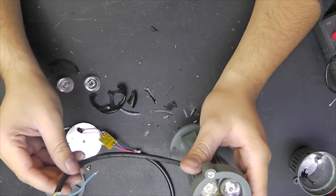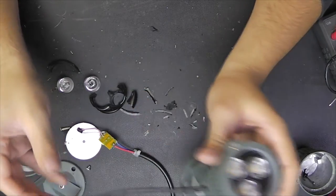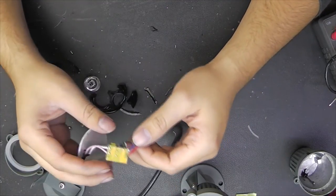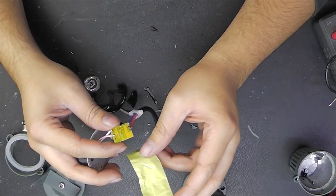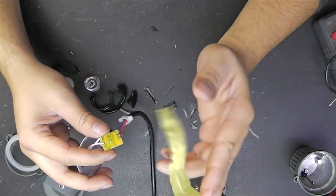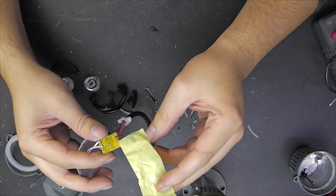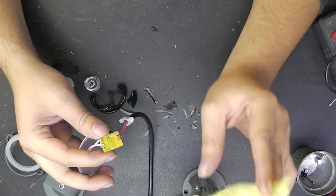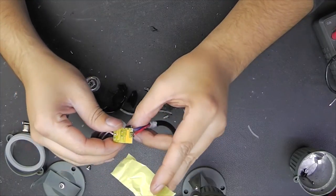I would not recommend to buy this, especially if you are really mounting it outside, because this little power supply is in no way going to be completely water sealed, and I would bet that in some way there is water creeping inside the case, and in a good case it is shorting out the mains lead, neutral and live. And if it is really bad for you or whoever touches it, it just shorts the live to the case, and well, whoever touches it gets fried. Would not be so amusing, I guess.